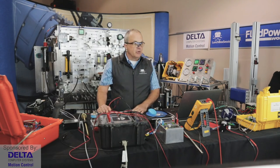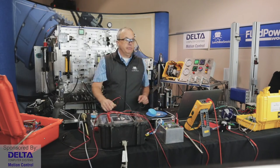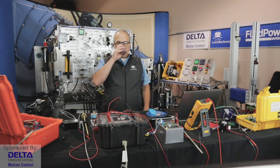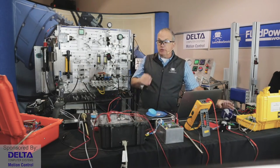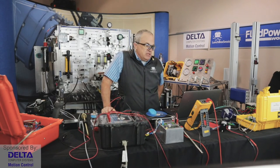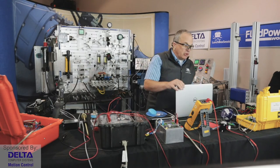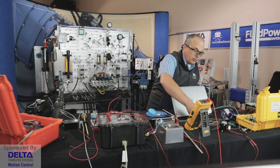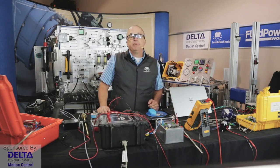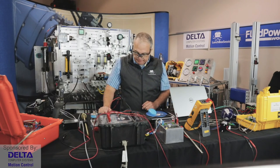All right, let's get underway with our technology and topics today. And of course, keeping track of temperature in hydraulic fluid, making sure that hydraulic fluid does not overheat, is important to do. We've had a very hot summer, and heat was certainly an issue for many that we work with. So typically hydraulic temperature is often measured in the tank as fluid is returned from the hydraulic system.